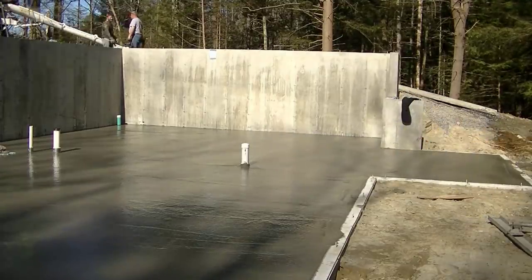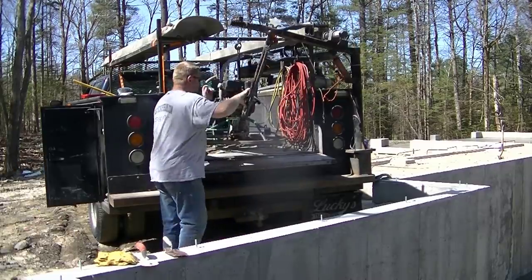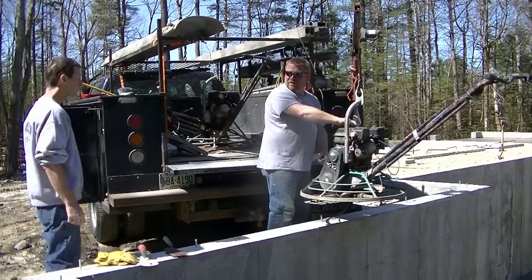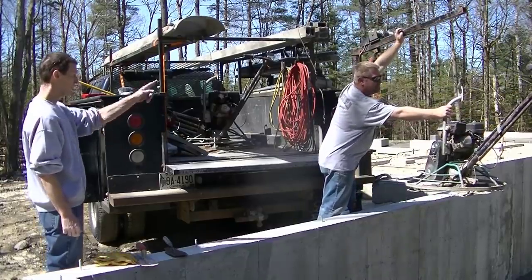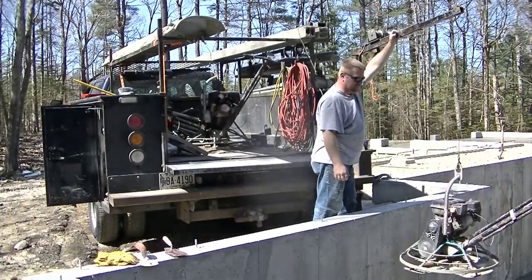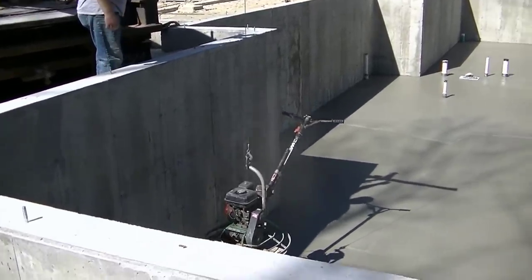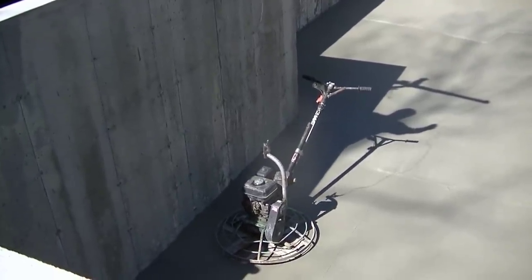Now I'm going to show you a little of what we do when we start finishing these floors — check this out. I don't know how many of you have a crane like this, but this is key if you're going to finish concrete floors and you work in an area with basements like this. For taking the power trowel in and out of the truck too, this thing is invaluable — you just hook onto it with a crane that has a wireless remote. We put a winch on top; it didn't come with one but you can buy a good wireless winch for under a hundred bucks. Then you can lower the trowels right down inside the basement. We have 30-inch, 36-inch, and 48-inch trowels — it'll pick all of those up. That'll be coming up in the next video. Thanks for watching!